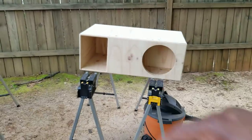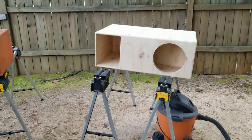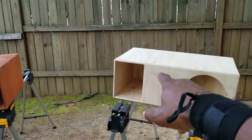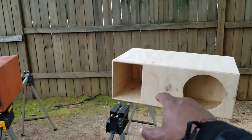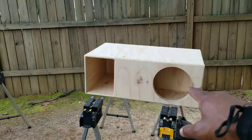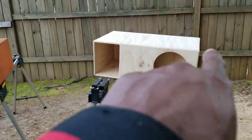The horn mouth must be equal to or greater than the Sd — the speaker diaphragm area of the woofer — to properly project the sound. Here it's about 30 percent larger than the Sd of the round circular sub. It's almost like comparing a Kicker cone against a traditional subwoofer — about 20 percent more cone area. In a horn enclosure the horn mouth must be equal to or greater than the Sd of the cone.